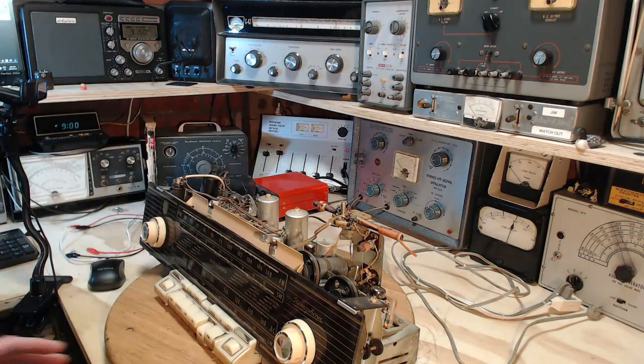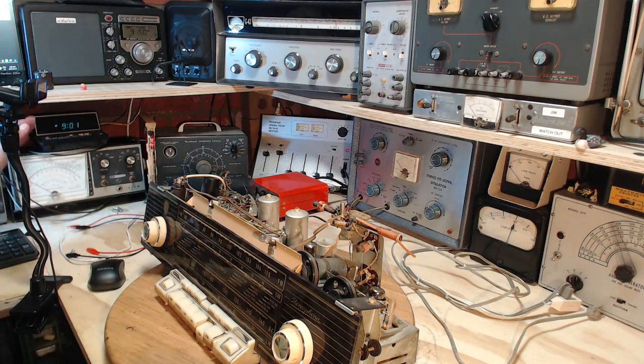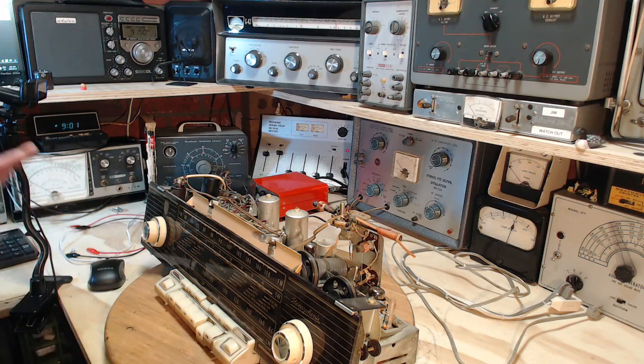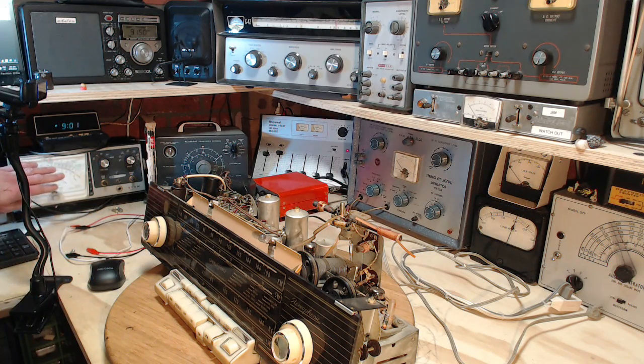What has really got my attention is why am I getting 145 volts or more on the case of this meter, depending upon how you measure it. I've been doing this for decades, so this is not something new to me — finding a little bit of voltage on the case of an instrument like this, or on a radio with a semi-live chassis. I've been dealing with this stuff forever. One thing I've never seen is a voltage beyond the line voltage. I never checked the chassis of anything to ground and found something greater than the line voltage. In this case, I even checked the output voltage of the transformer inside this meter — it's almost the same as line voltage, I think it's 135. Still doesn't explain 145.